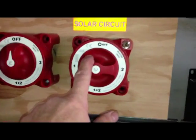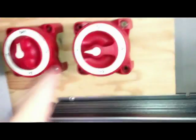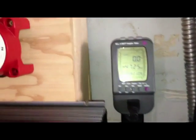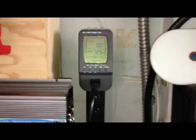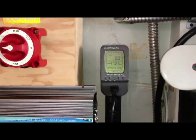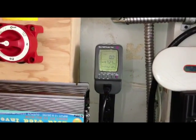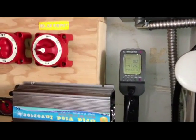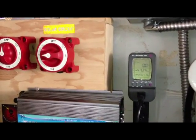I've got about 500 watts coming off of my hybrid array — the array I can flip to go to battery, which I'm doing now, or go to plug-in cheapo grid tie, which I'm not doing right now. I just looked at it before — it's about 500 watts. So I'm probably pushing in 1.2, 1.3 kW total from my array. The whole array is about 2.4, 2.3 kW. That's what it all adds up to right now — so we're getting there.